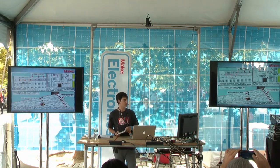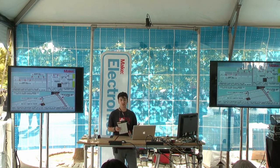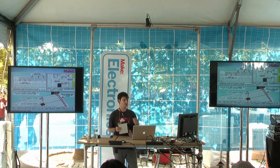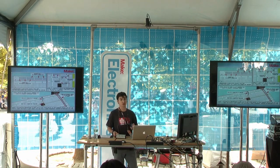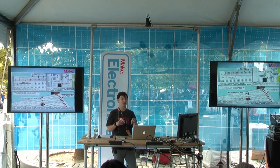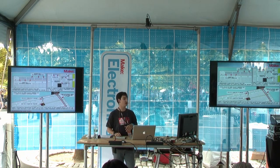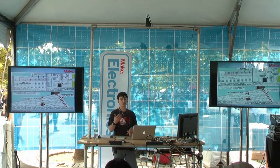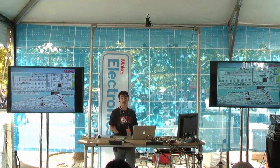One way you connect components on your breadboard is with other components like resistors and capacitors, or with jumper wires. Jumper wires can be made of flexible wire or solid core wire depending on your preference. I find solid core wire great because you can bend it and make these little road paths — almost like roadways — and you can visually see each connection really nicely. If you remember the beginning slide, there were all of those really loose wires scattered about. It's really hard to see what's going on; you have to trust that you did it properly, and it makes debugging a real headache.